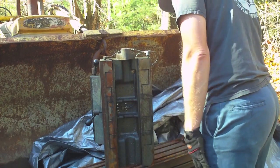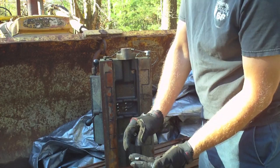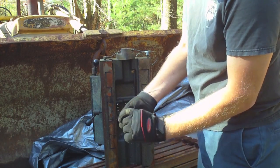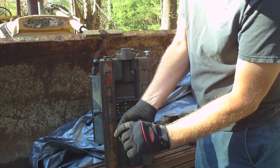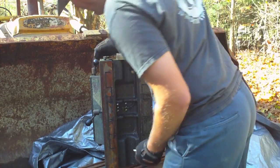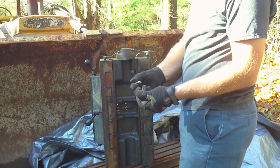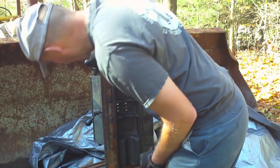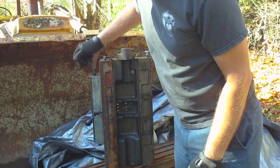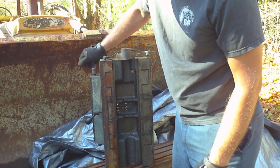Then I tipped it and this little short one fell out. It's the same style — it's got the taper and a threaded hole on one end and a taper on the other end. It fell out of somewhere. Because it's obviously a locking gib, I'm assuming it fell out of a hole up underneath here for this lock. One of these locks the table and this locks the saddle to the knee.